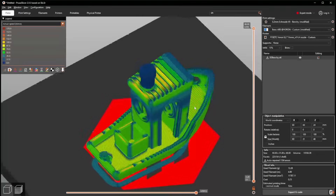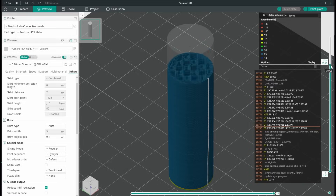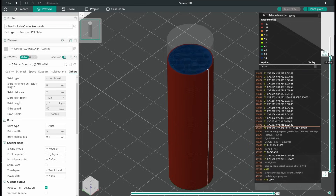Print speed and temperature heavily influence not only the strength of a part but also its appearance. While large areas can be printed at full speed, more delicate sections need enough time to cool down before the next layer is put on top. By default, the slicer will first spin up the cooling fans to maximum speed, and if this still isn't enough cooling, it will artificially slow down the printhead's movement. This can cause variations in outer texture — most materials develop a glossy texture when thoroughly heated, while faster extrusion results in a more matte finish. To keep texture consistent, the option 'don't slow down outer walls' comes in handy, though results depend on your material.